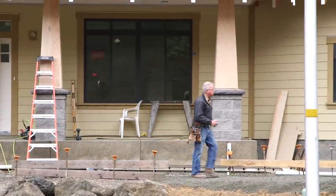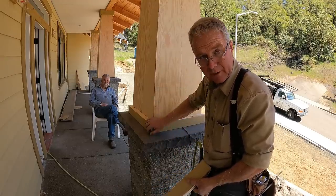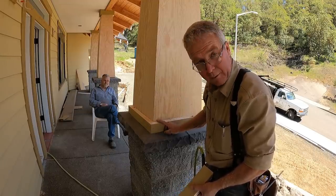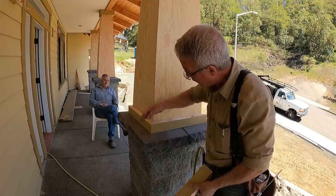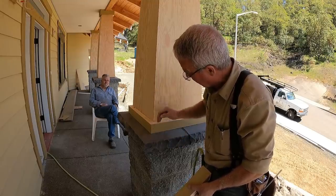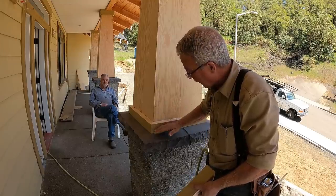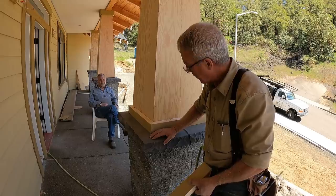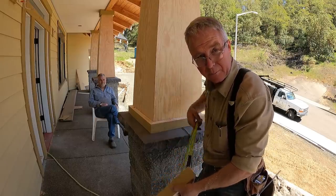So we've just about got this figured out. This bottom wrap went through several iterations, but I think we're closing in. We put a little bevel on here to create a water table that won't hold water. We've got a back bevel to get full bearing, and it sits down on the cast pretty well. I'm not going to fight the fact that these caps are not perfectly level — I don't think it'll be apparent. It's going to look good. I've just got to shave one little piece off, and then we'll put these together.